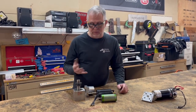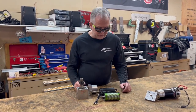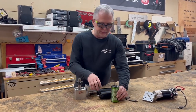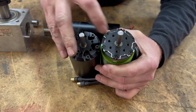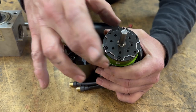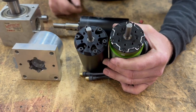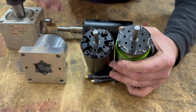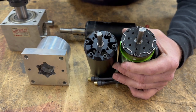I don't know that it'll have any more power than before, but I think at least it should be more consistent and I shouldn't have to fight with it to make it work. Unfortunately, that requires some changes — this motor has a different mount pattern and a slightly different diameter in the mount area. So the custom mount I made for the previous motors, which worked really well, is just not going to work with this motor. I'm going to have to make a new mount for this one.